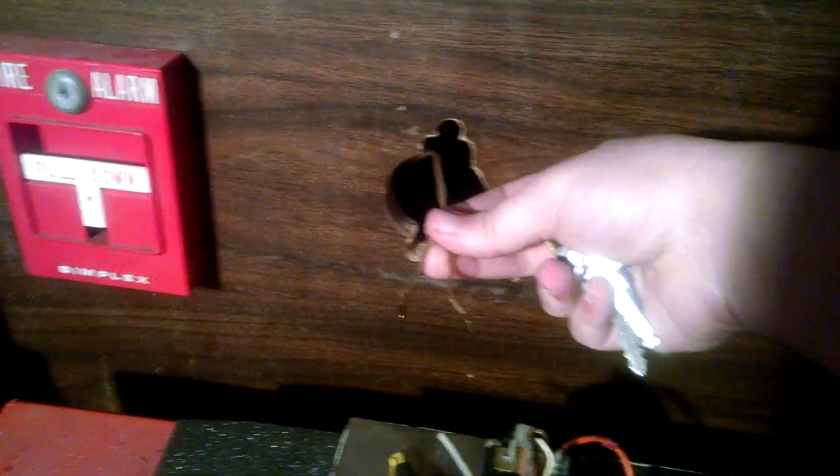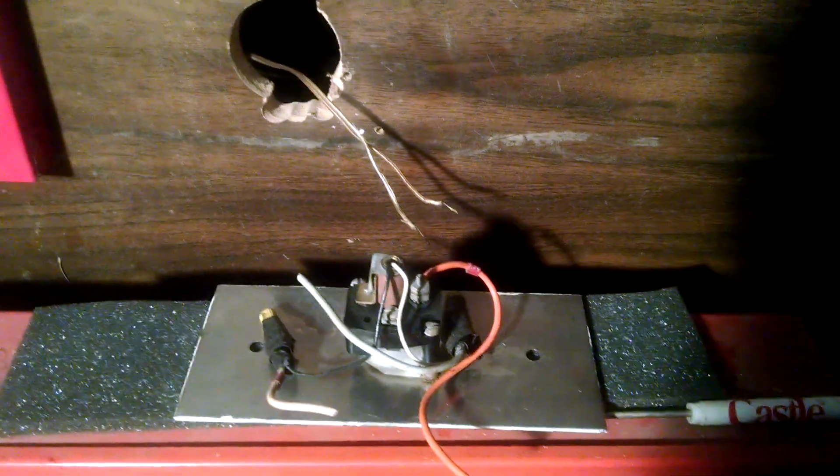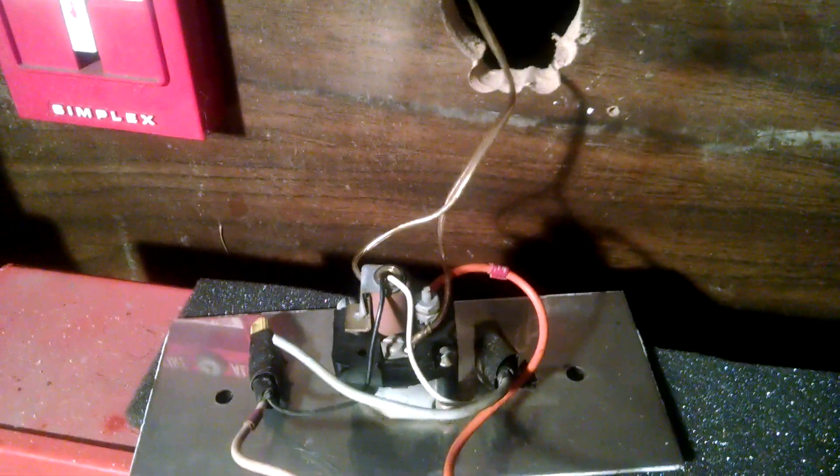This is the circuit for that particular pull station, which I have hooked up to Zone 2 on the panel. All I have to do is run those through the contacts of the button here, and it should only take a couple seconds. Let me hook this up and I'll be right back. This is now all put together and ready to go — this should fit in the little hole here on the display board, so I'm going to get this set back in, then we'll give it a test.